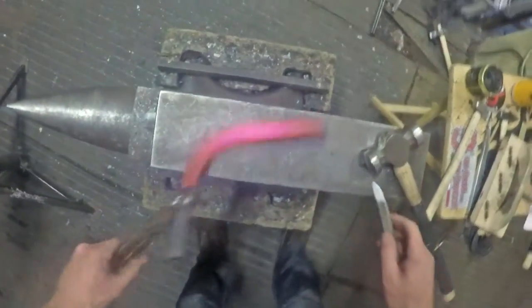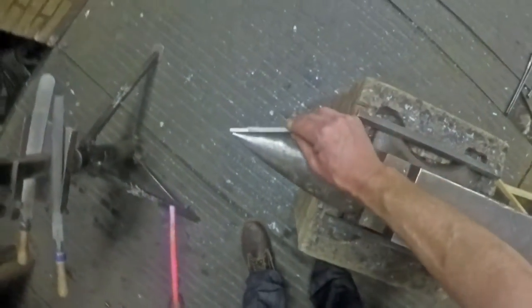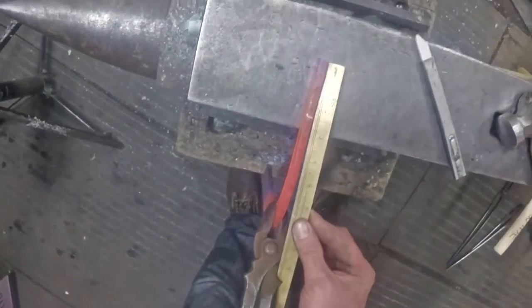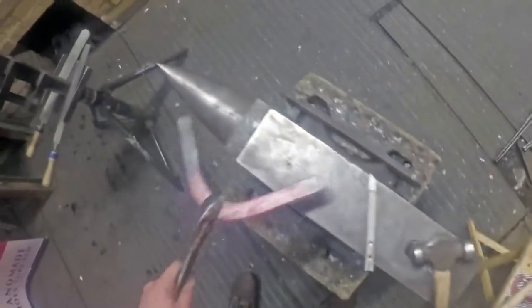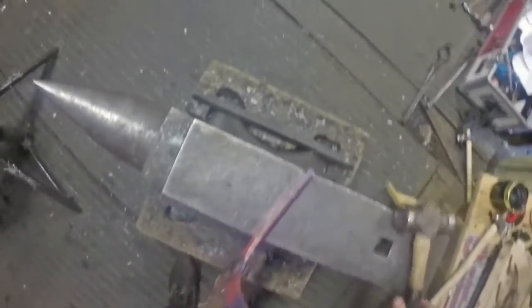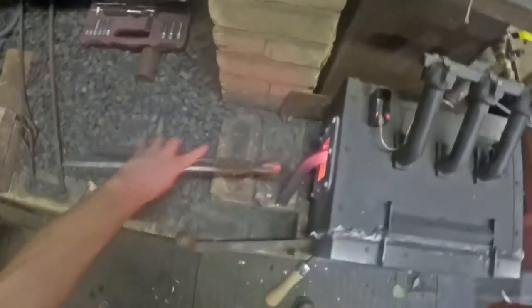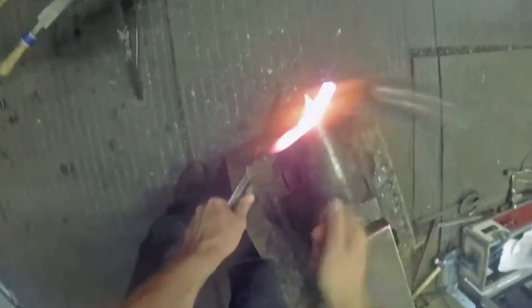What I'm going to do with this now is put a hockey stick on it. I'm going to go over to the narrow end of the bick, have it at 90 degrees - so the bick's at that angle and my shoe will be a perfect 90 degrees. I'm going to forge over roughly two and a quarter inches, which is about 56 millimetres, just until it goes to an angle of just under 90 degrees, then put it on the anvil and back it up. I want a nice sharp corner on that outside edge. Any shoe you're welding, try and keep it as clean as you can especially in the area you are welding - brush it before you hit it. So I've got roundabout two and a quarter inches over the bick, forging it to just under 90 degrees, keeping the branch of the shoe on the anvil and forging that down until I get a sharp corner.